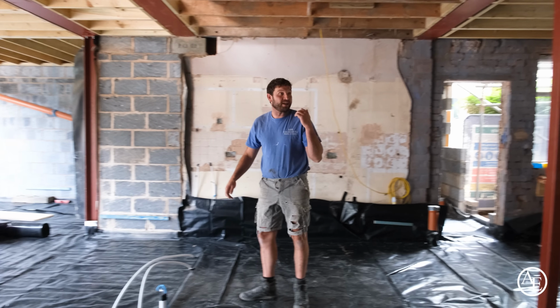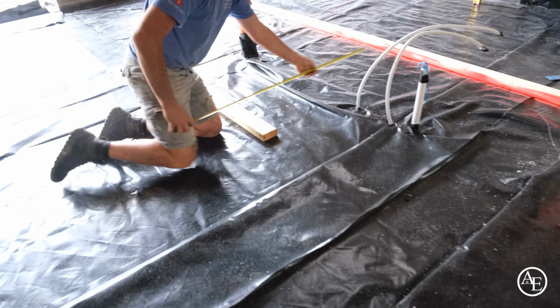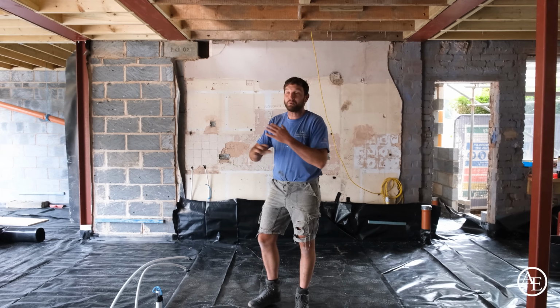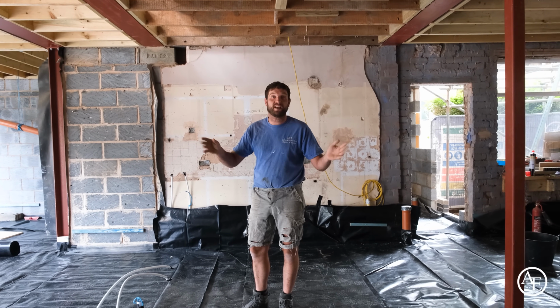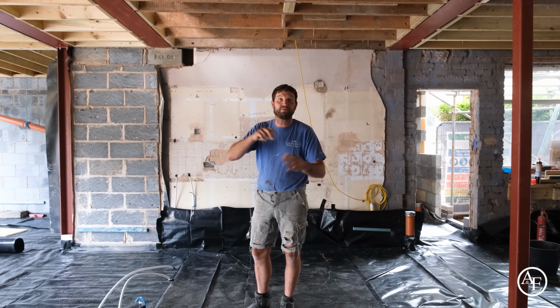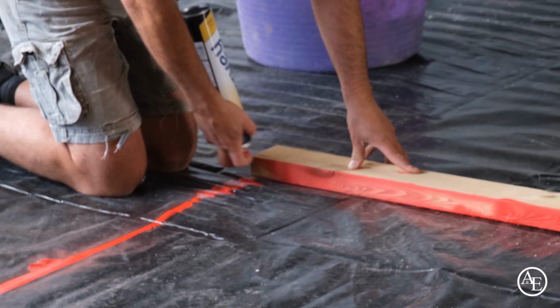hole. So me and Nev are now going to the technical drawing room. We're going to mark out all the cabinets, where all the ceilings are going, stud work, etc., so we know where not to lay the pipe and where we can lay the pipe. It stops any potential for screws going through the pipes and all the rest of it. So we're just going to crack on with that. That's the next stage.